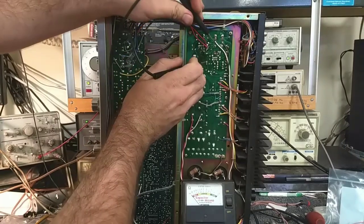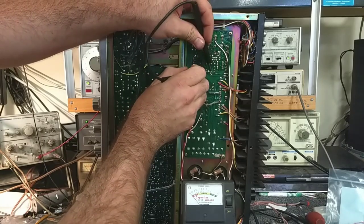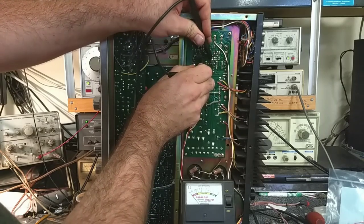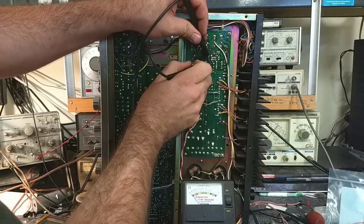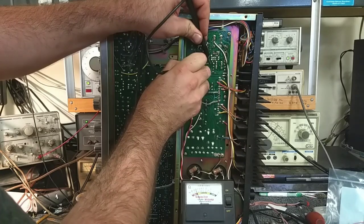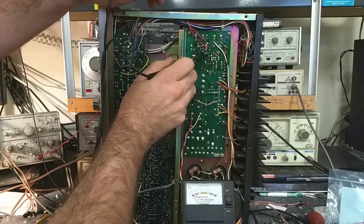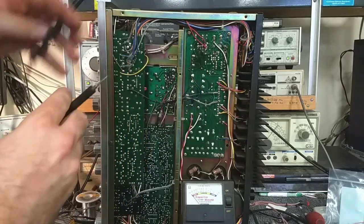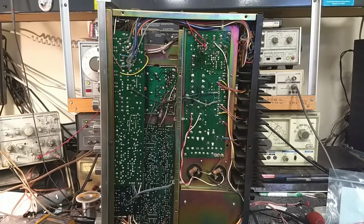Here's your 47 microfarad — that's about dead. Here's the 1 microfarad — actually it's still hanging in there. And then here's the 220 — also mostly dead. So it's both of them. Both the 220 microfarad capacitor and the 47 microfarad capacitor have expired. We have a combination of dirty power and not enough capacitance to charge the relay circuit and make the relay fire.